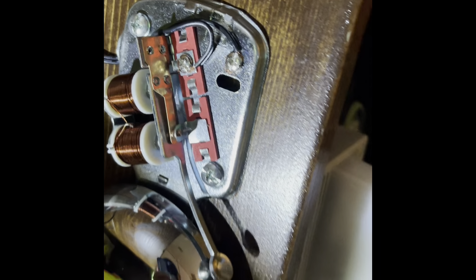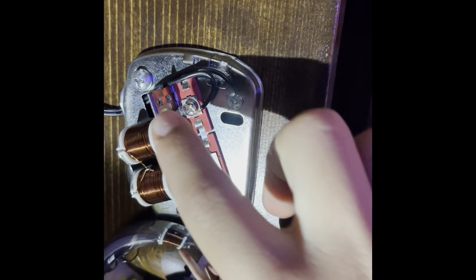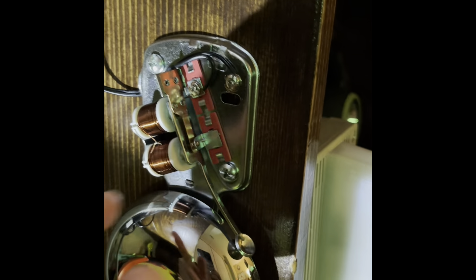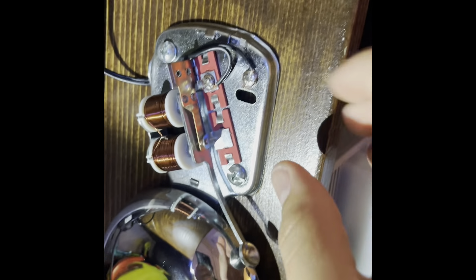The wiring didn't record in the second take, so I couldn't see the terminals and I'm not doing it a third time. What you do is take the cover off — you might have to unscrew it, but this one just snaps on and off which makes it easy. There are two terminals, one and two. It has an electromagnet-type design, so one terminal runs directly to the bell coils and the other on the red runs to the knocker.